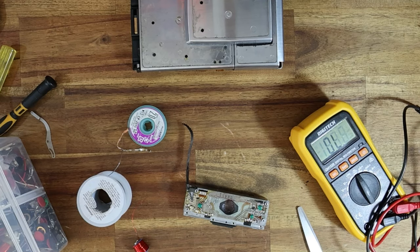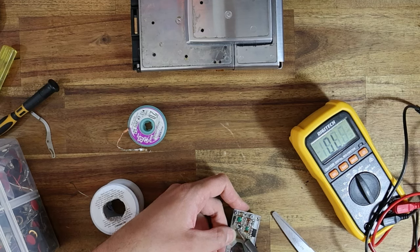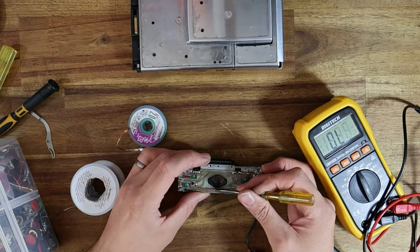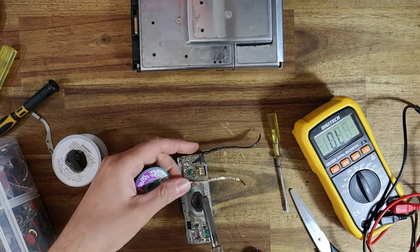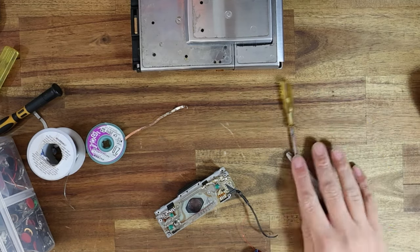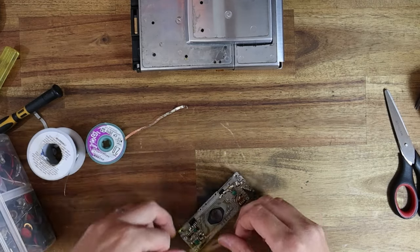Conversion of a W shutter back to standard is only really possible if you happen to have one of those walking arms in stock — I have several taken from scrapped cameras. If you don't have them, there's no way to convert it back to normal, unless you were to fabricate one of those walking arms, which would be a lot of effort. But if I have the parts in stock on a camera I'm refurbishing for someone, I'll always give them the option: do you want to make your camera more usable with flash?